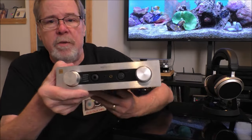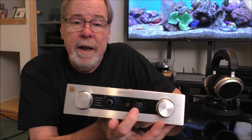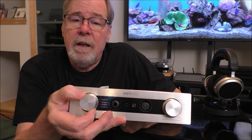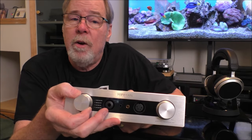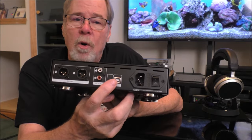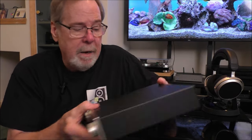It is really basic — a very simple device. This is a volume control, and it is not a preamp; this is just volume for headphones. You've got XLR balanced, 4.4mm balanced, 3.5mm unbalanced, and quarter-inch unbalanced. This dial allows you to select between gain modes — high or low gain — and in each of those gain modes you have an oversampling or non-oversampling mode. On the back, very simple: power connector and master power switch, USB input only — no S/PDIF — single-ended out and balanced out. So it is a fully balanced DAC headphone amp.